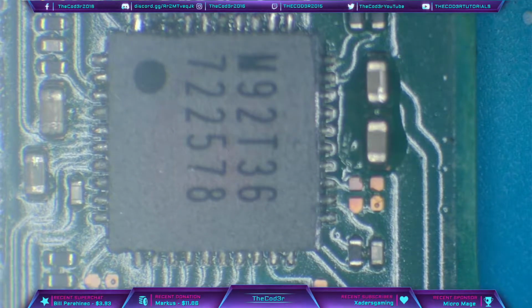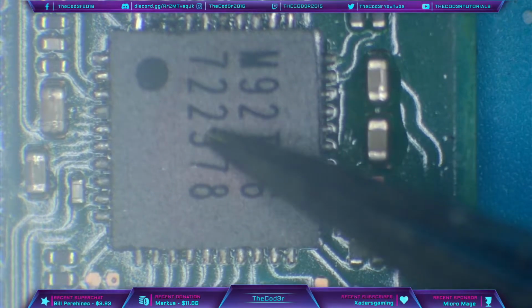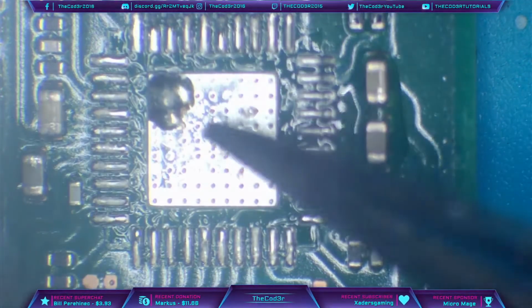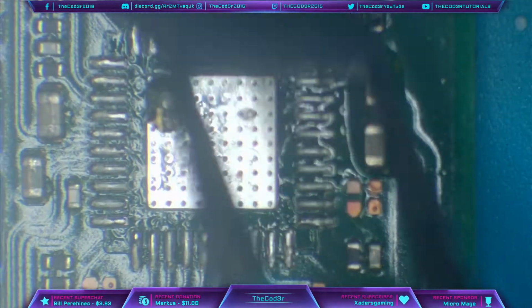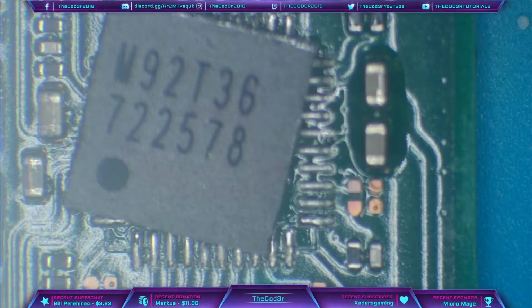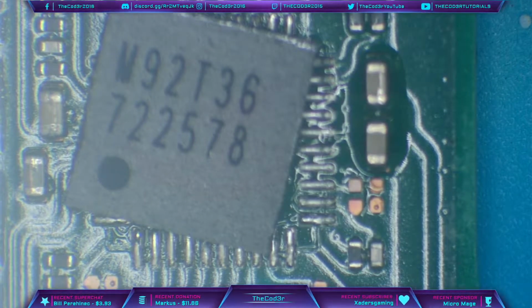And one thing you're going to notice is I have not changed the solder from lead-free solder, and that's because there's just absolutely no reason to. So all I'm going to do is just tack this down into place. Whoops, so I've just blew it off. And that's not meant to happen. So let me just knock my airflow down. I should have knocked that down anyway and I forgot. So I'm going to knock my airflow down to 30%.